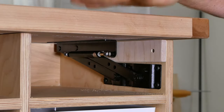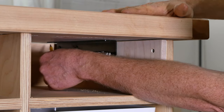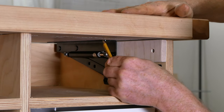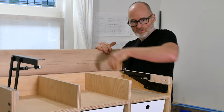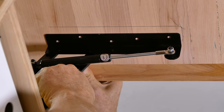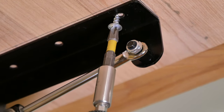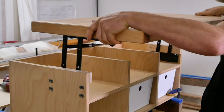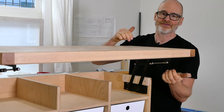Let's go ahead and do that right now. I've got the tabletop sitting on top here nice and square, and now I'm going to reach in and mark all the way around the flange for this bracket. Then you can slide your tabletop off, raise the brackets up, put the tabletop back on, line everything up on the marks you just made, and then get underneath and carefully pilot and put a couple of small pan-head screws in. I'd recommend just putting in a couple of small screws first and checking to make sure the whole thing operates cleanly before you commit to really fastening it down.